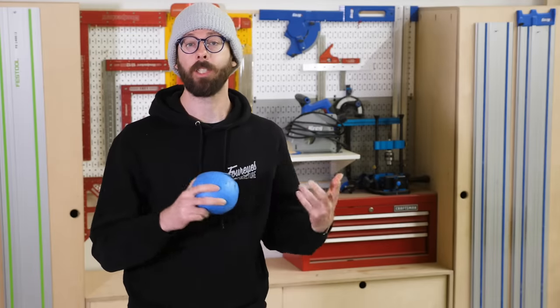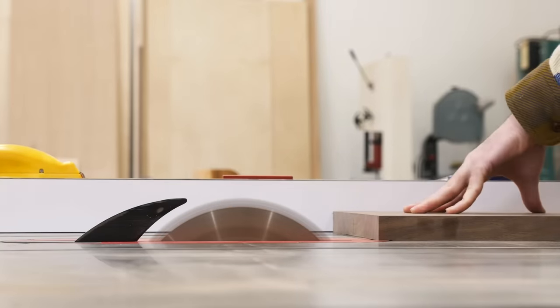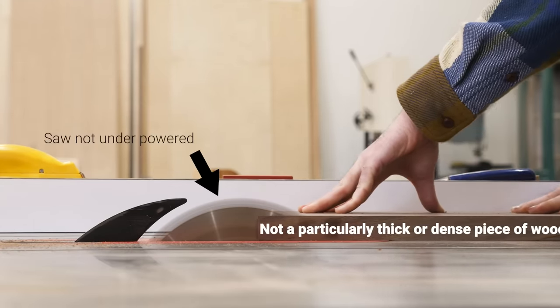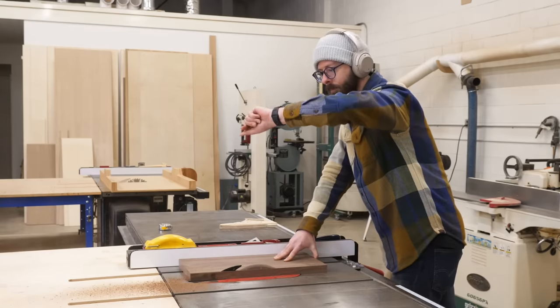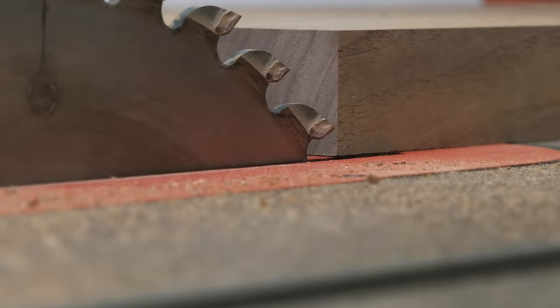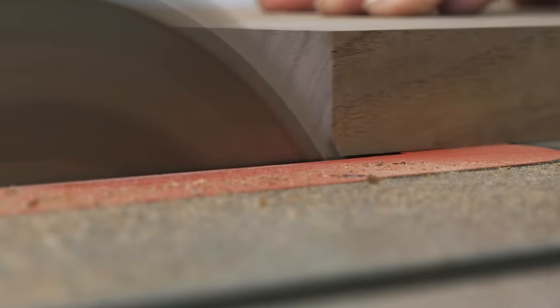I do, and this one comes from Jeff Carrion from Parkridge, Illinois, who submitted a really good tip about how to get cleaner cuts on a table saw, particularly when cutting long tapers. Whenever you're making rip cuts and the piece is thick, dense, or the saw is underpowered — basically anything that causes a slower feed rate — it's not uncommon to get burn marks. Something I've done for a long time is make a first cut leaving the piece about a sixteenth of an inch too wide, then remove the last bit in a second rip for a cleaner finish.